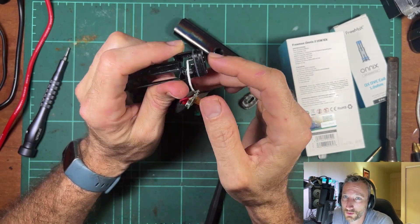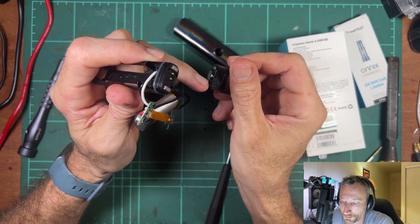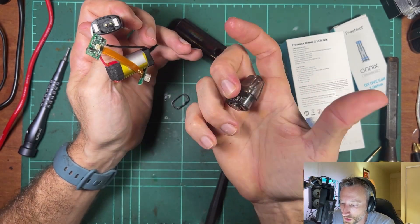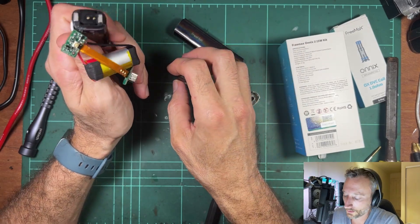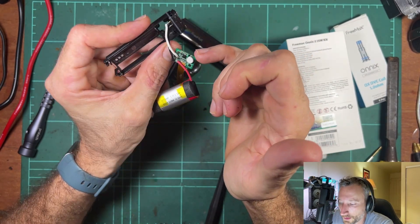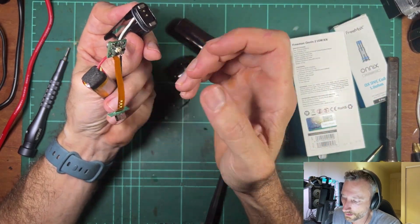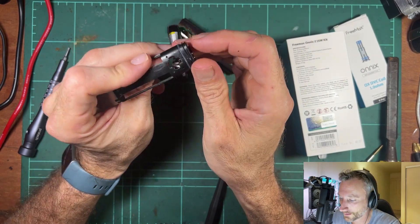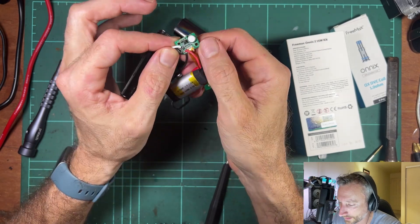I used it for about a month — that's normal use. I made sure the pod wasn't wet where I filled it, I'd wipe it off, and occasionally stick a tissue in to soak up condensation. So I'd say the liquid on the board is the cause of our issues. There's some conduction from the liquid on the board. It hasn't outright failed — it still fires — but as soon as the battery comes down from about 90 percent it just flashes like a lunatic, won't fire, and won't respond to anything until it runs completely flat. Then you can charge it again, use it for a couple of minutes, and it does it again.